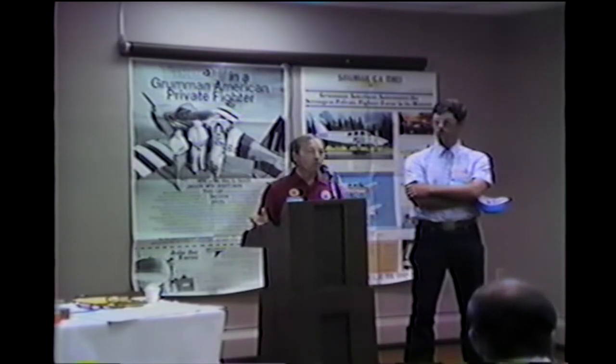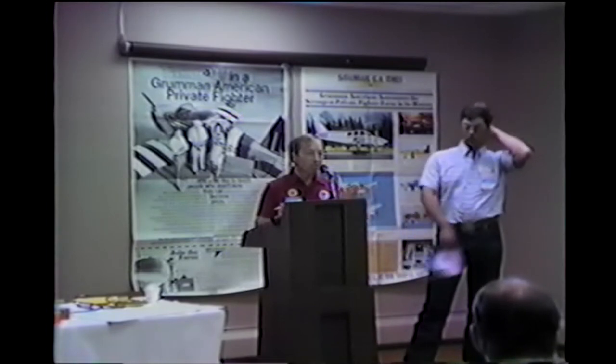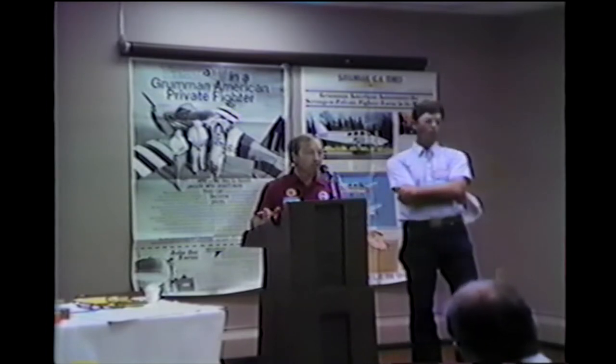I would advise you, though, the next opportunity, to remove the elevator tips and go back in the back and trim a little bit of that plastic off where it butts up against the metal in the back to give you a little more clearance up front. Also, inspect around the front. You've got a metal rib inside of that thing that it screws to. If your plastic is extending past that, get a file and file it off. You can do it without doing anything other than raising and lowering your elevator.